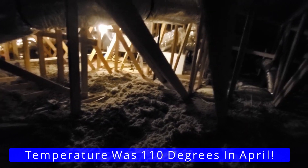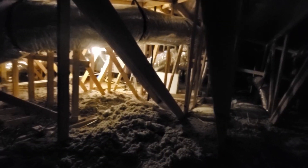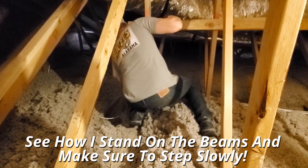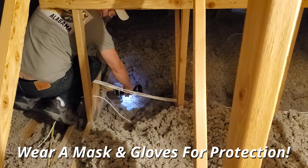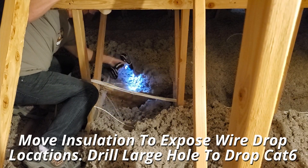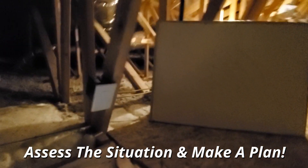Also, do these wire drops in the morning or late at night, especially if it's hot outside. Our attic gets to be 110 degrees, and that's just in April — in May, June, July, August, we will never go in that attic. So do these in the spring or winter time; that's the best time. Take your time when you're in your attic. When you go up there, open it up, look around, make sure you've got plenty of light — there should be a light in your attic, and bring a flashlight or a large light so you can see everything. Always wear a mask up there because of the insulation. Take breaks and come back down to get fresh air. Tell somebody you're doing this in case you do fall through, so they can call for emergency services. Assess the situation of areas you can walk into, because some areas you can't reach where the rafters are low — so know that before you drop into any walls.